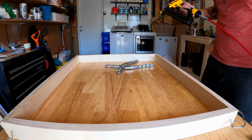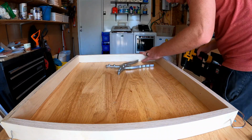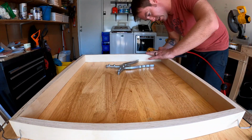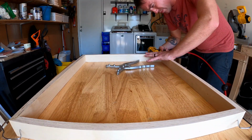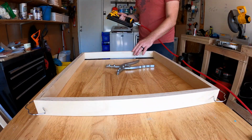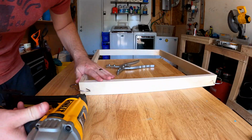After you finish cutting your miter joints, you should have a nice square frame to put together. Add wood glue to your corners and clamp using either a 90-degree corner clamp or spring clamps, which is what I like to use. They do put an indent in the wood, but nothing that can't be repaired later with wood filler.